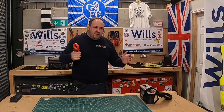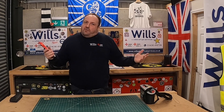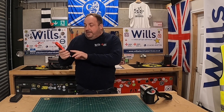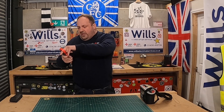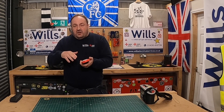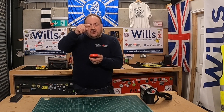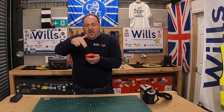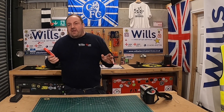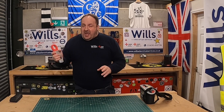I'm not trying to teach, I'm just showing tips — I'm a qualified electrician and tester but not qualified to teach. What you can do with this, which is really good, is when you've got a circuit through there — especially on the tails — you can go through each individual MCB and it will reduce as you go along, so you can actually find the fault circuit that way. It's absolutely priceless.